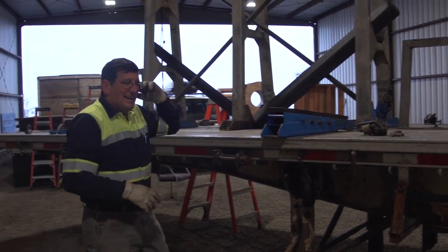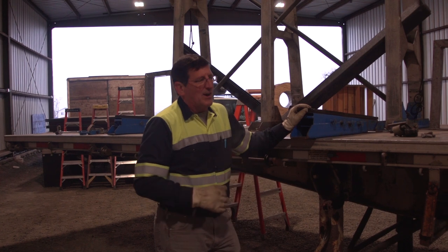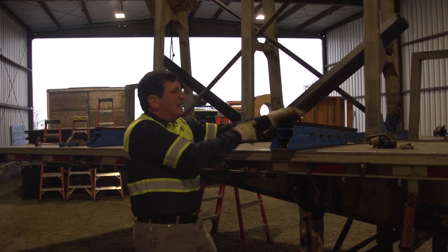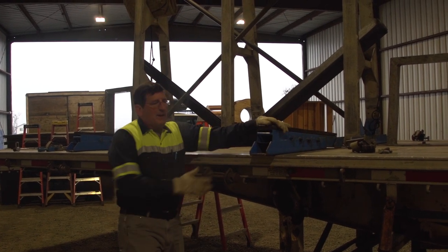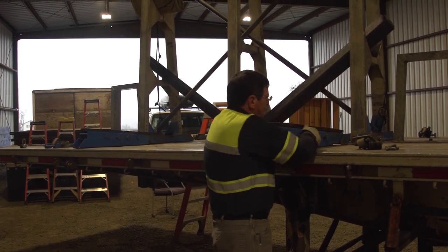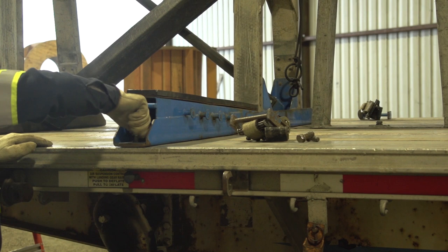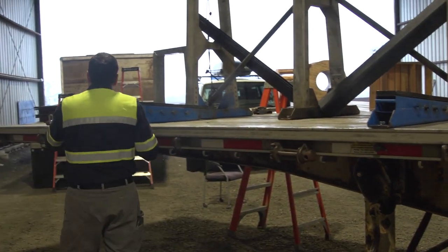The reason that I don't put these feet out until very last is a safety issue. If it's hot outside, your heart's racing, you've done a lot of physical activity — you may not be the best balanced at that moment. Bending over from up there and putting these feet in, especially if it's somewhere really hot, is not a good idea — bending over a four-foot edge when you could lose your balance. Just come down here; it's safer. So these feet go in, go up, go over that channel, and come down where they belong. I'm going to go ahead and tighten this down as we go.